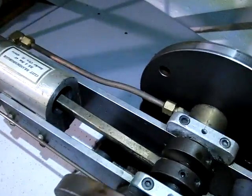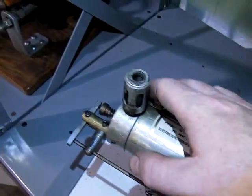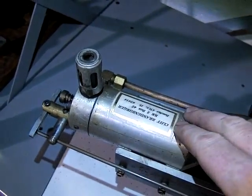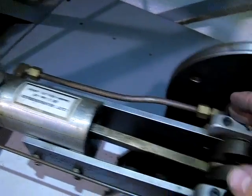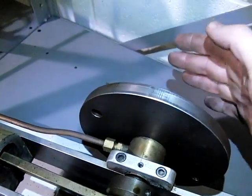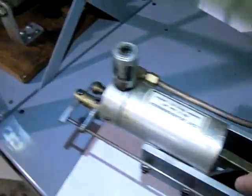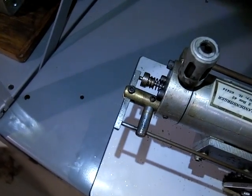What's different about this engine is it has a rotary valve for the air supply, turning on the cylinder and pushing the piston down. On the exhaust stroke, this line is cut off, but instead of coming back to a rotary valve to exhaust out through the flywheel like his other engines, it has a second eccentric on this side running up on a conventional valve up on the top here.